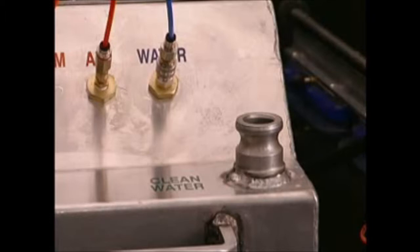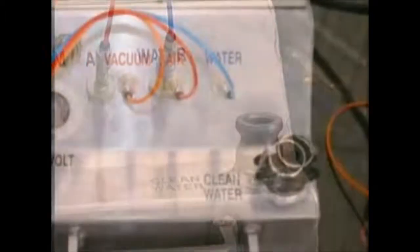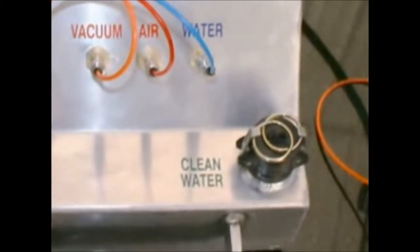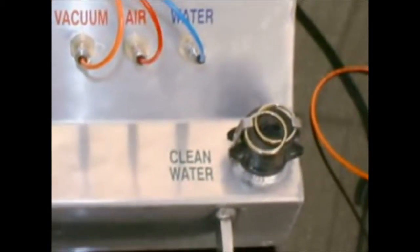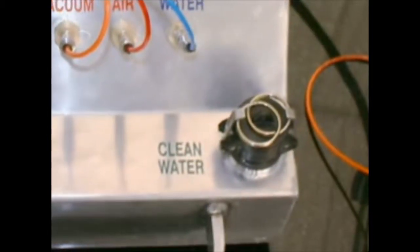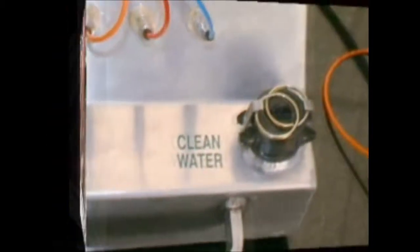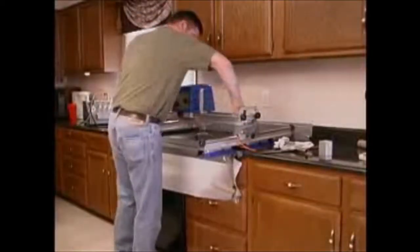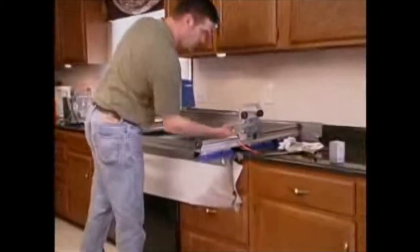We recommend you empty the water reservoir after using the machine and before starting transport. A reaction between the metal and the water could generate particles from oxidation. Should this occur, the particles could clog the water lines and reduce performance. Completely wipe the 4 linear rails with a soft cloth sprayed with WD-40 or a similar lubricant.